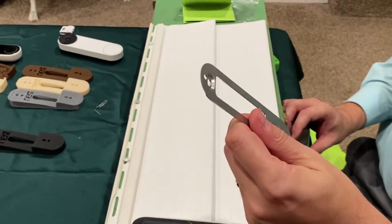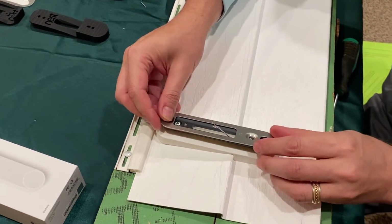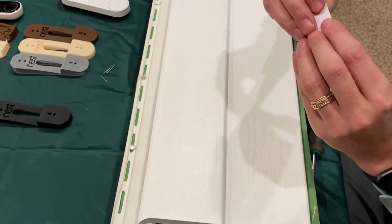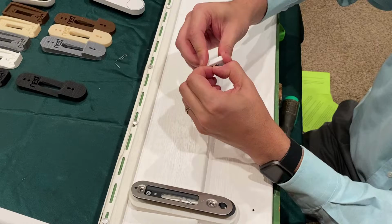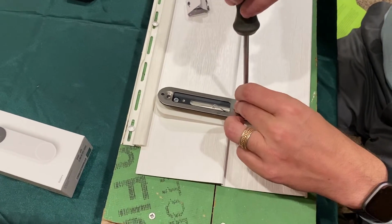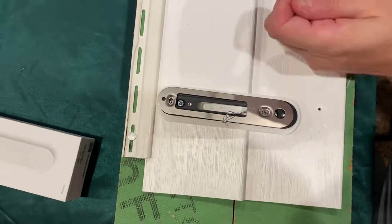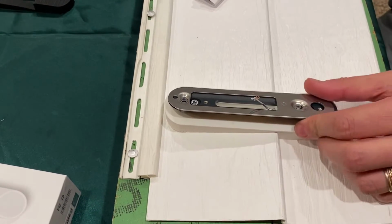So now you'll want the backing plate for the Nest battery. And you'll want to position it on here. And as you'll see, 2 of the holes line up with these threaded inserts. And then you'll want to get in your little kit, the 2 threaded inserts are these 2 tiny screws here. You will use these, and this is how you attach the backing plate to the angle wedge. And now all 3 should be secure together.